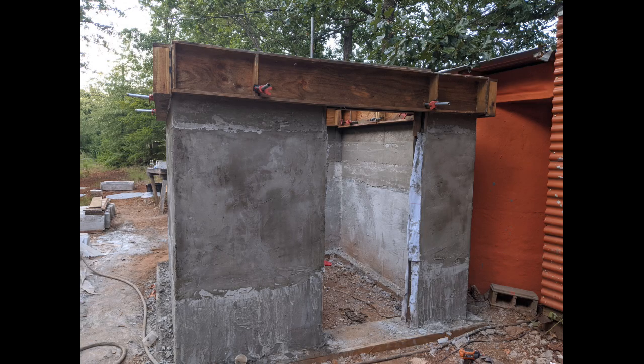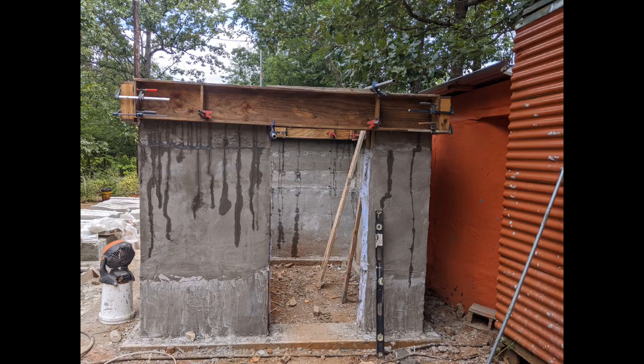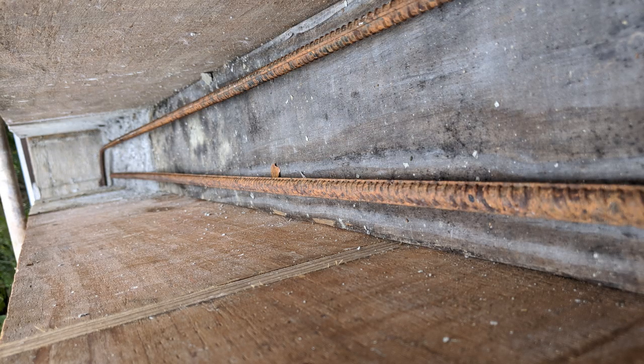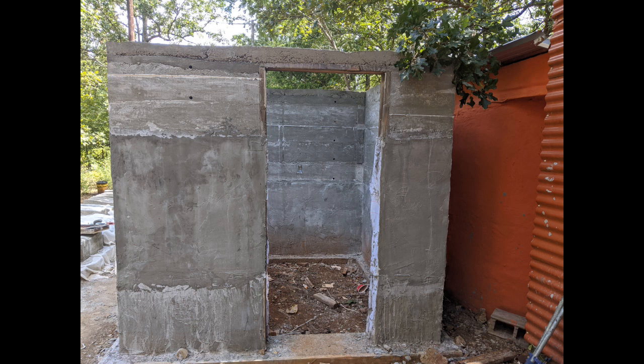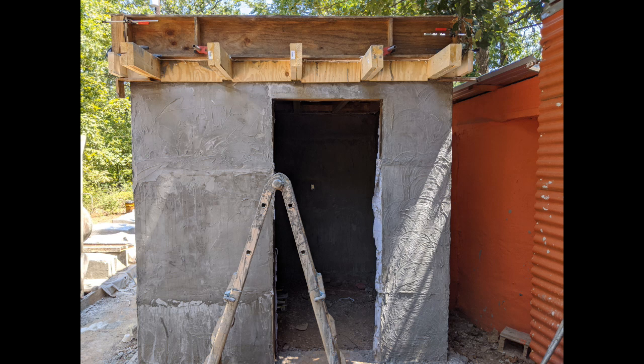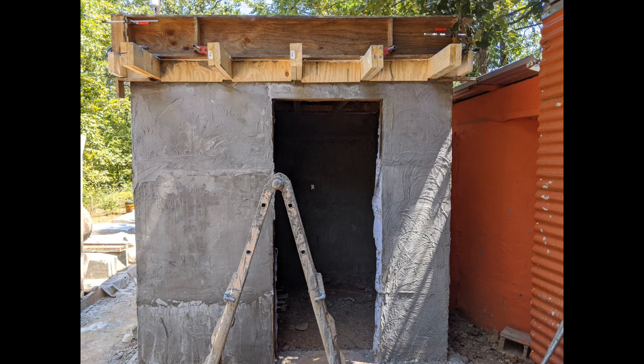It's actually quite nice to build this way — you don't have to feel guilty about not doing enough. You just come out, mix aircrete for an hour, clean up your tools, and you're done. Once we reached the roofline level we put down a bond beam and installed support roof beams that protrude through the structure in classic pueblo style. Then we laid roof decking — actually floor decking — and poured another six inches of aircrete on top, then set the slip forms one more time to pour up another level to make it look nice.